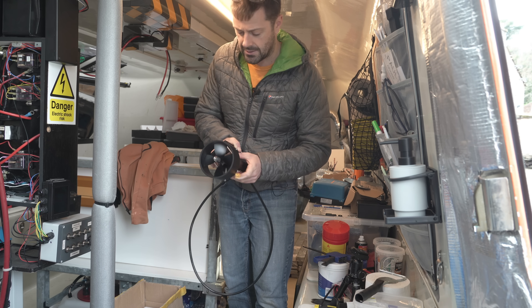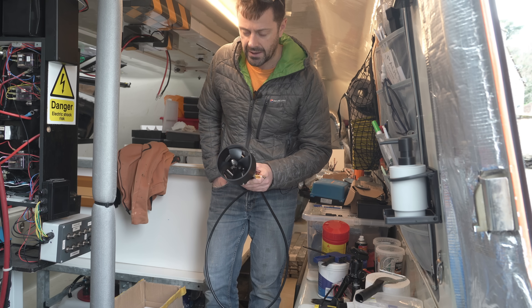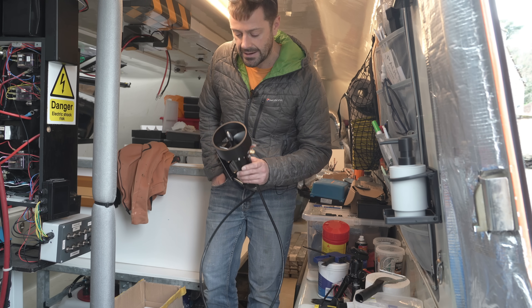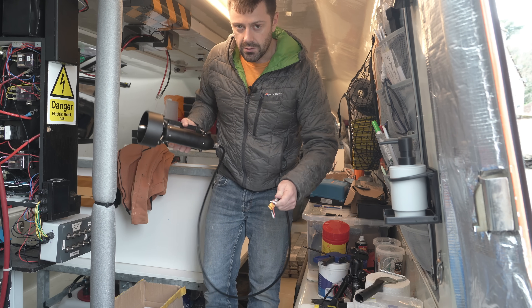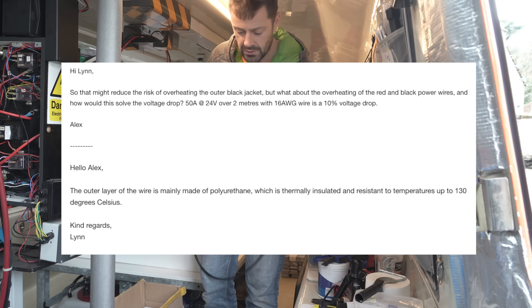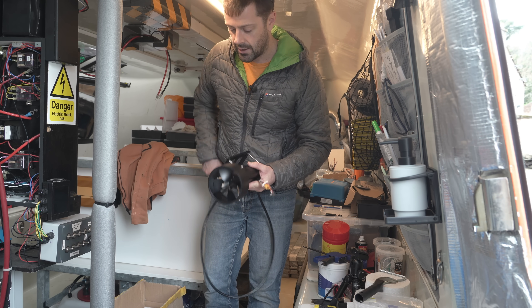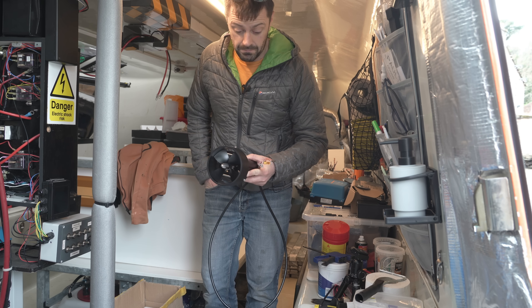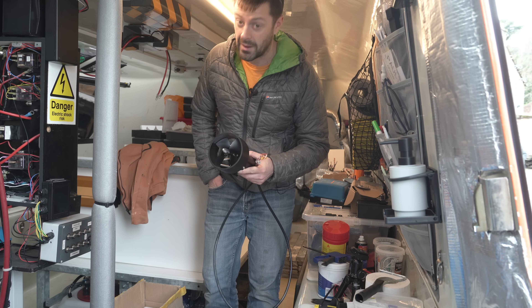So I'm going to do a test. Their argument, as far as I could work out — and I'll put a couple of excerpts from the conversation I had with Lynn at Apis Queen — is that because the cable is going to be under the water, that takes care of the cooling. I don't buy that, particularly because some of the wire is going to have to be in the air; this bit here isn't waterproof. So at least some of this cable is going to be above the surface of the water and it's going to heat up. I'm going to do a test at full power, full chat, and basically see what happens. This is within warranty, and believe me, if this is not safe I'm not keeping it and they're not keeping my money.